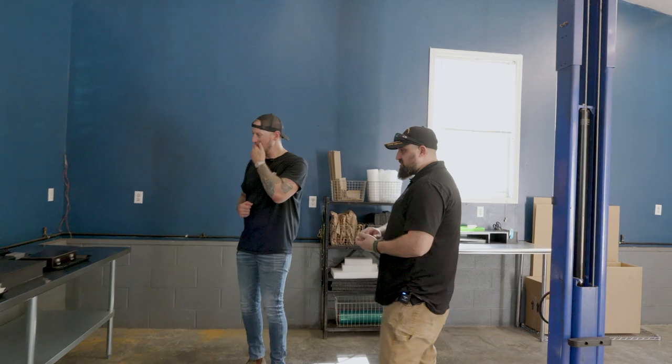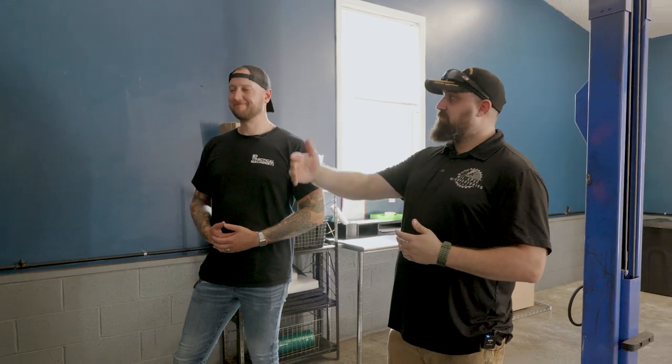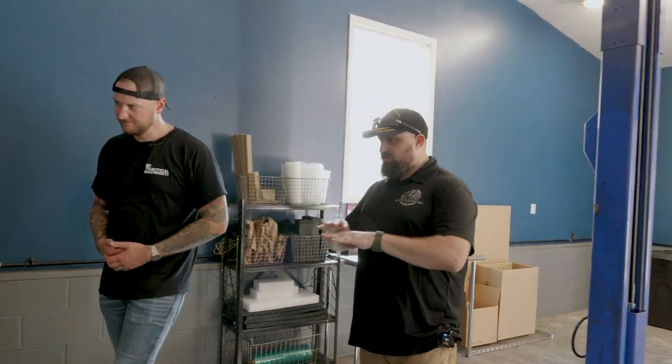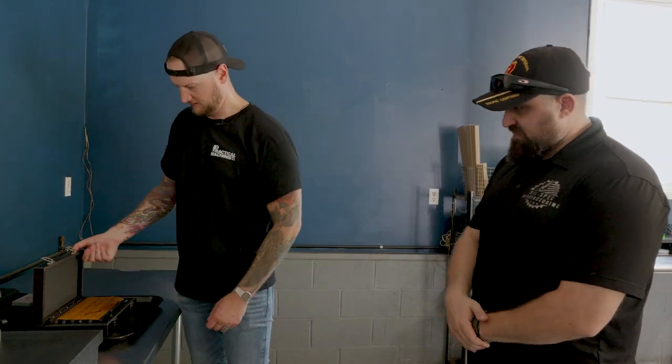The inspection area is general and generic but very functional. As a startup you pay yourself, cover costs, and reinvest some money back into the company — gradually building up the inspection area with more pins, gauges, and blocks. Current equipment includes a height gauge, an indicator, and gauge blocks. You don't need a CMM or a dedicated climate-controlled room for most general work. Fundamentally it's the same as Ian's shop, just with a bigger granite plate and a few extra tools.